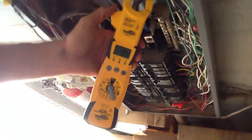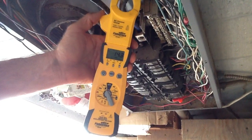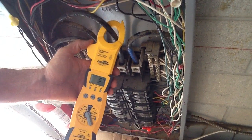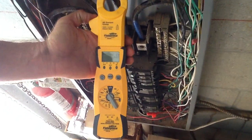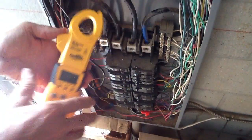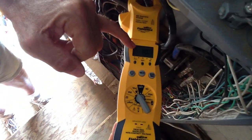This is the C phase, so we're pulling 14.3 amps. That's all the current — that's the lights, the air conditioning, the motor loads. The center phase is only pulling 5.8 amps. The A phase is pulling 10 amps.